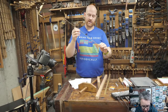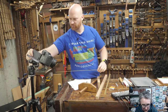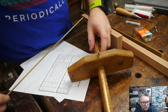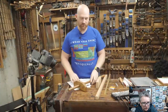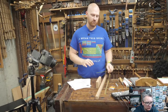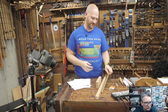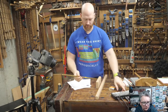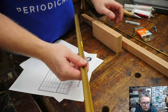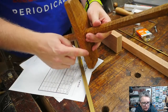This part is optional: we have an eighth inch by eighth inch brass rod — it's just a wear strip that goes into the top of the beam so when you put your screw down it tightens onto that rather than the wood. If you don't want to do that you don't have to; your wood will probably wear a little bit faster but it may only last 100 years instead of 200. We're also going to have a brass wear strip, a piece of half inch by half inch corner stock.